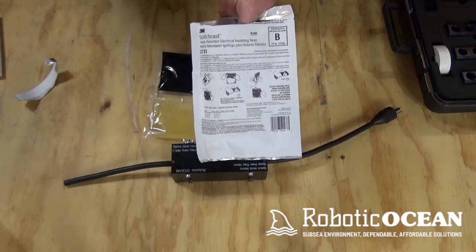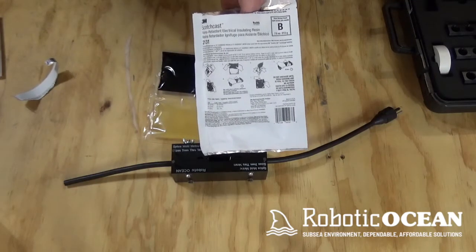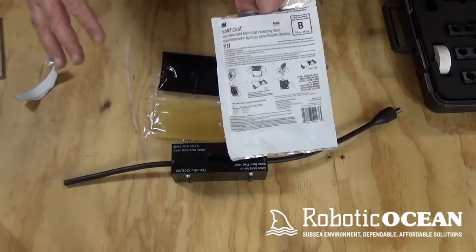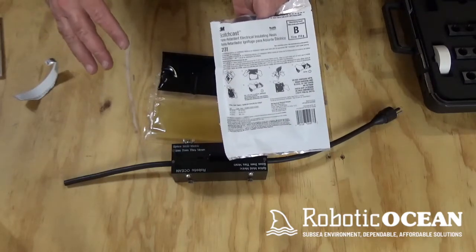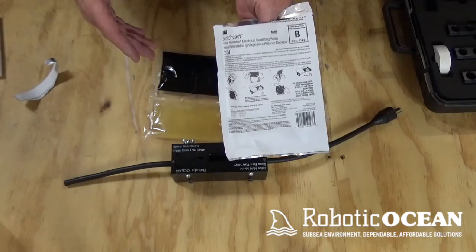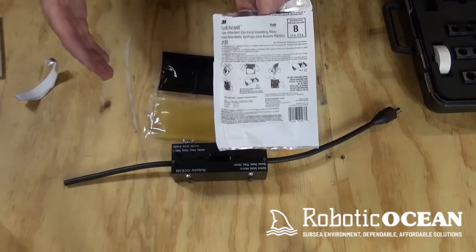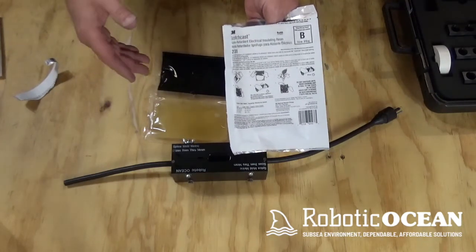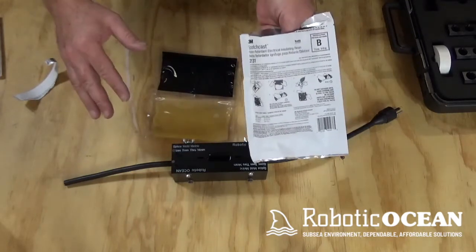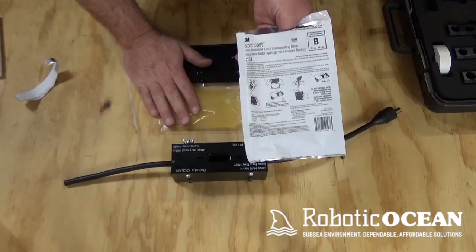This is a quick fire epoxy. This is for field use, so that it sets up really quick and you don't have to wait for stuff out in the elements too long. Okay, we do sell different epoxies or urethanes for in-shop use that are a little bit slow cure, a little bit easier to work with. However, this is all about field service right now, so we're giving you the stuff that you're going to see out there in the field.